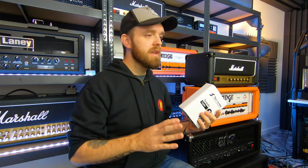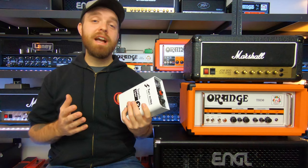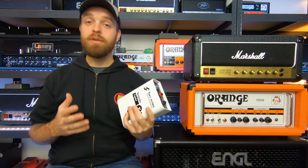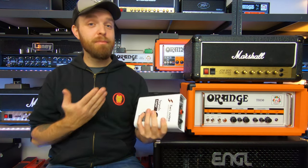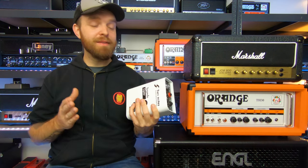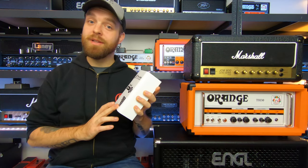It's a bit technical, but that interaction basically has an effect on the feel and sound of a tube amplifier. In short, a good reactive load box is supposed to make your amp sound as if it's really attached to a real cabinet. And then, since there are no guitar speakers attached to the amplifier anymore, which do have a huge impact on the sound, you're going to have to emulate the sound of speakers. That's where the speaker emulator and IR loader come into play.